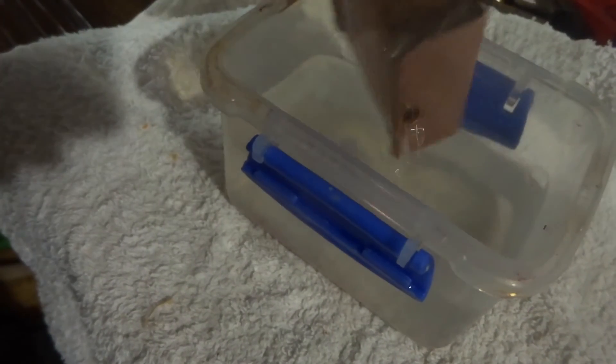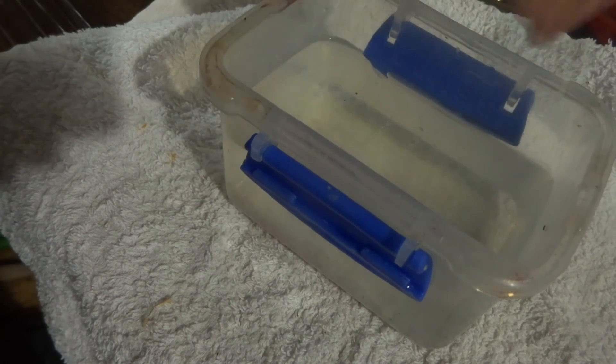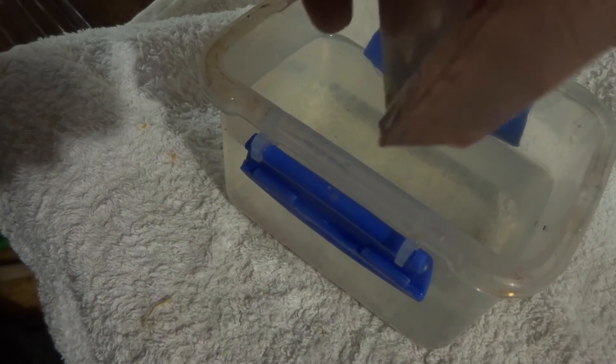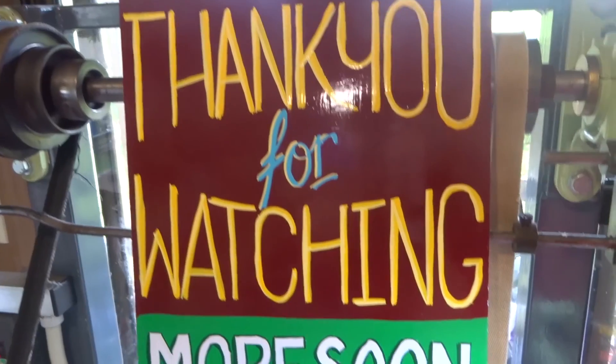I've given this a bit of a clean up, it's all soldered nicely. This is citric acid - you buy it at the homebrew shop or just at the supermarket in small quantities. I'm just pickling in cold water with that, which has brought it up nice and shiny. It's got a pretty good seam around there. That end's a bit rough because it got a bit hot and the solder ran down, but this one's nice - a nice seam with a groove. I think that's pretty watertight. So that's the tank and the soldering job done. Thanks for watching guys, more soon.